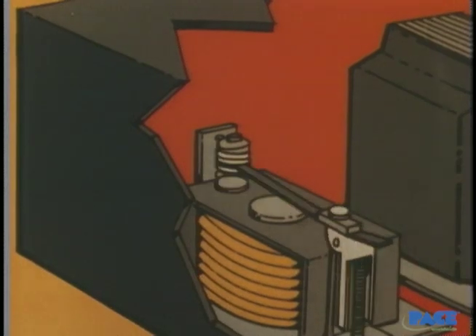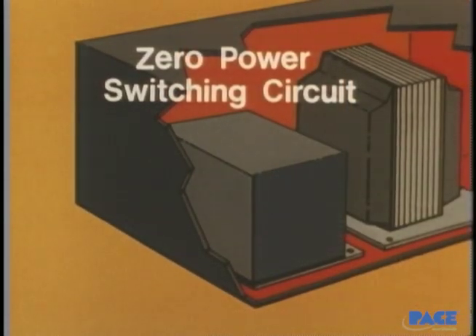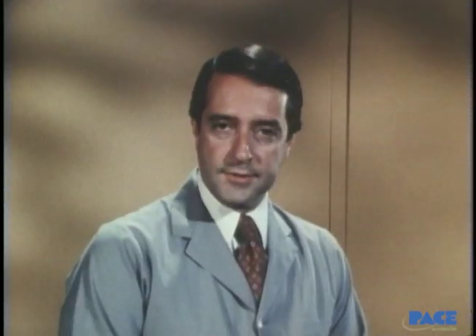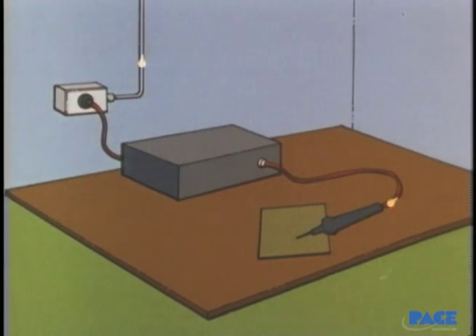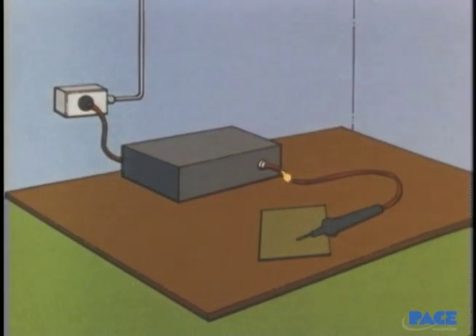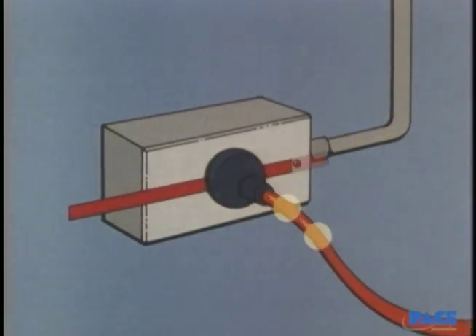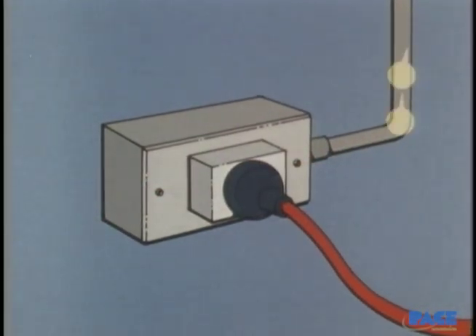If your equipment is switching these loads, you need to be sure the equipment incorporates zero power switching methods to prevent spikes from being generated. Another source of the problem can be the power line itself. Brush motors, relays, and any non-zero-powered switching equipment may be connected to the line somewhere else in the building. They generate spikes and could be injecting them into the power system. They come down the line, pass through your equipment, and right into the board, even though your equipment has zero power switching. The place to stop this is back here, between your equipment and the power line.